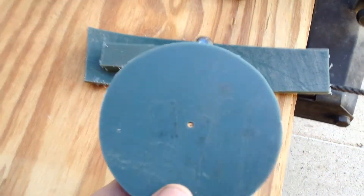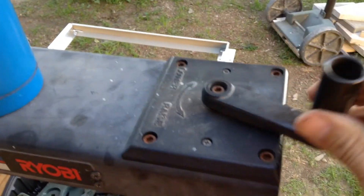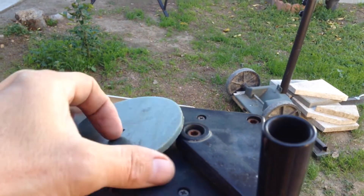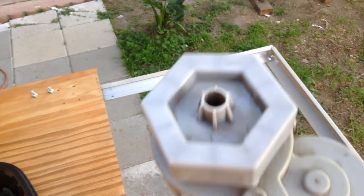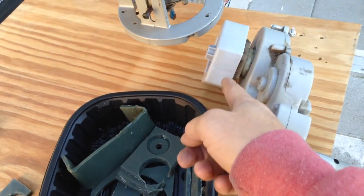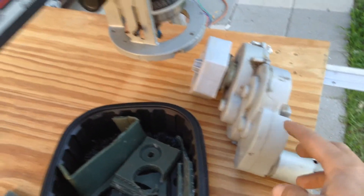For the next part, I'm going to try to make a gear out of this plastic so I can hook it up here, because if I connect the motor directly it's too hard for it — I'm going to need a gear reduction, maybe 3-to-1 or 5-to-1 ratio. I'll try to make the gears from plastic, and then put a smaller gear on the motor. Alternatively, I found this gear assembly from a kids' electric car a long time ago — I'm going to open it and see if I can hook up the motor there for higher torque. So thanks for watching.